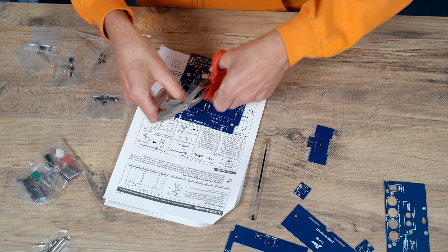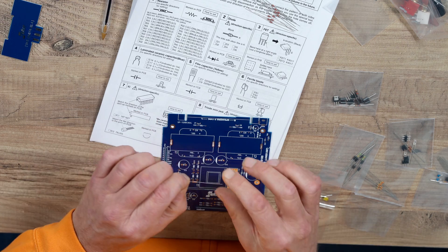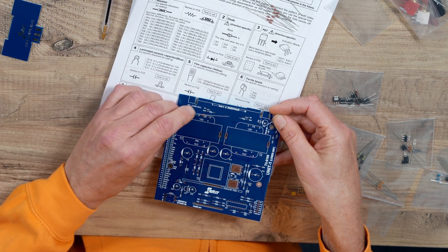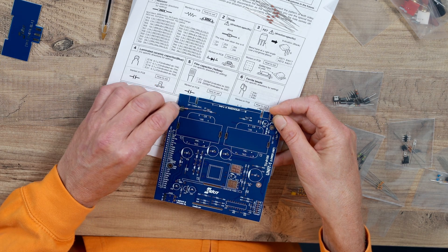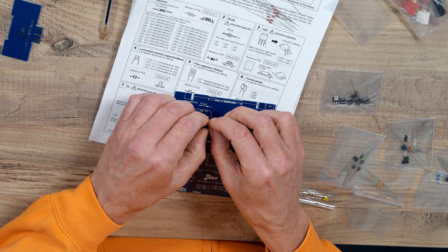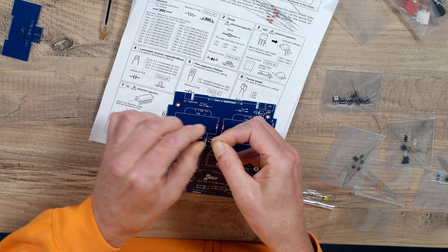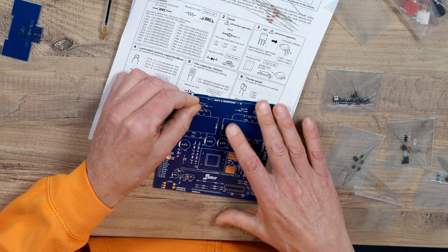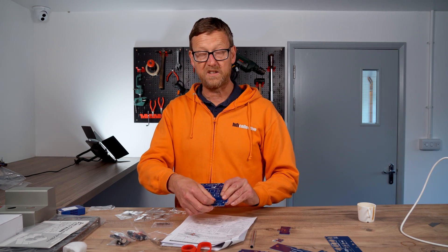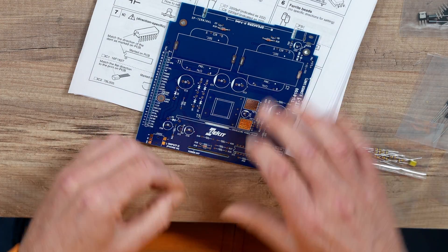You can see on the board that this is R19 — there's a certain pitch between the solder holes, so you want to get your resistor kind of in the middle. Bend your leads out before you insert, approximately the right spacing, and just push them in. This is a straightforward process, so I'm going to populate the board with all the resistors now.